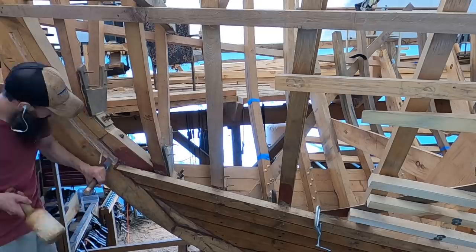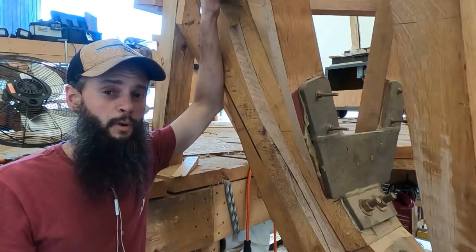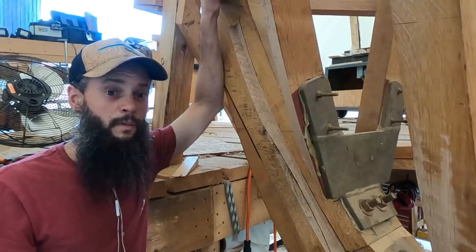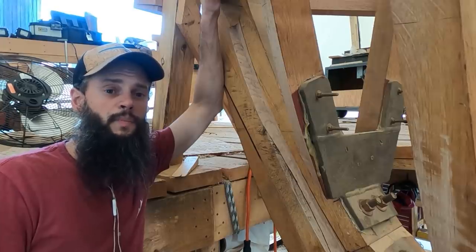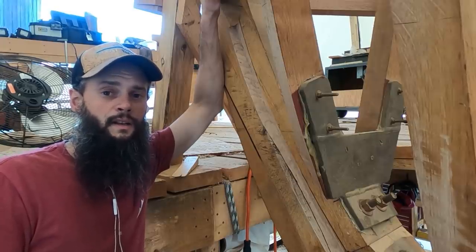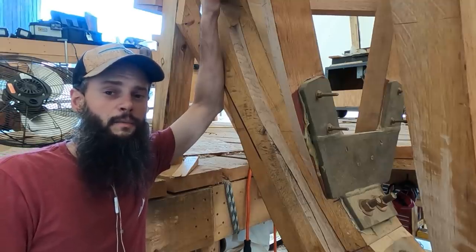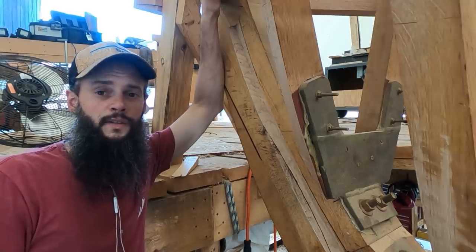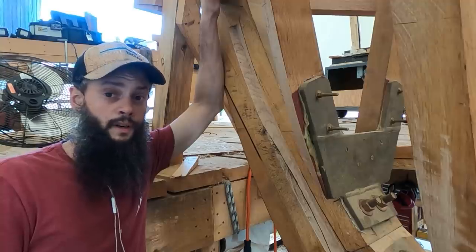So, rabbets are pretty much done. So I'm hoping tomorrow that we'll see about putting a cedar on the boat. Fingers crossed it goes all right. Stuff seems a little temperamental. But up here, there is way less twist and there's a lot less shape, so there'll be less edge setting. Everyone who works with cedar says that it'll bend, but the common thing is that it doesn't like to twist. And I think that's what we're really fighting in the stern, and we won't be fighting it anymore. Hopefully the cedars will go on easier. We're gonna find out real soon.